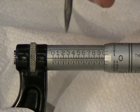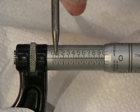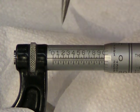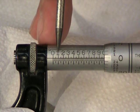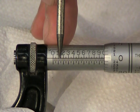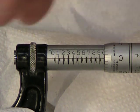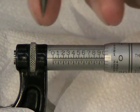The fixed scale is divided into 0.1 increments, which in turn are divided into 0.025 increments. Each line along this scale, regardless of its length, is worth 0.025 of an inch — so 0.025, 0.050, 0.075, 0.100, 0.125, 0.150, 0.175, 0.200, and so on right up to one inch, because the amplitude of movement on this micrometer, as on most imperial micrometers, is one inch.